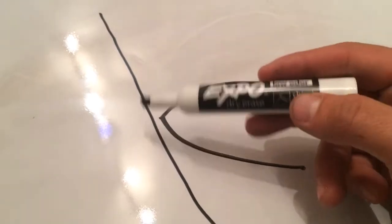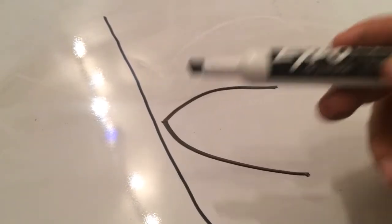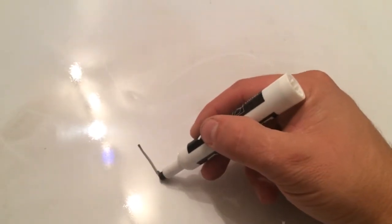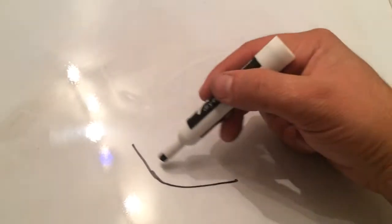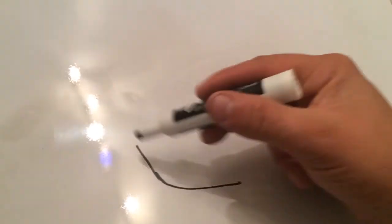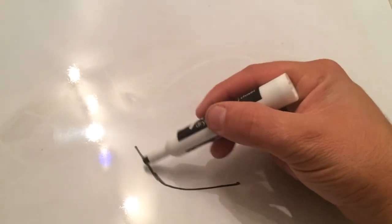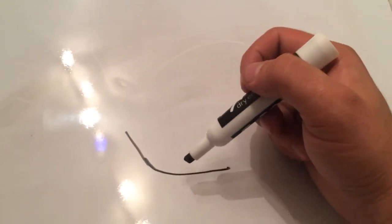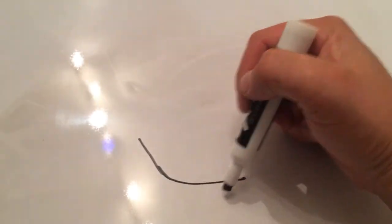So once you start using this V-grind to get rid of some of them deviations at the tip, you want to go right back to using your sandpaper method right away, because anything that you started making flat at the apex, say it was flat and you started rounding it out. This is kind of a bad drawing, but say it started getting flattened out at the apex, and the rest of it's rounded, just like you can kind of see on the knife. You want to start trying to use that sandpaper to round this out as best as you can.